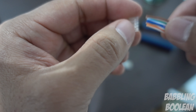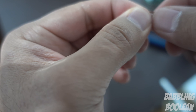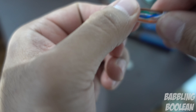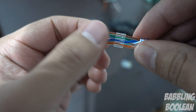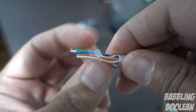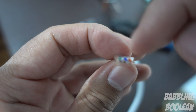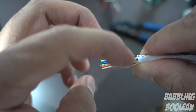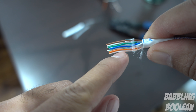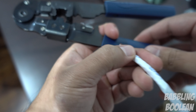We need to play around with this a little bit to get it to slide in. Once it's in, I double-check the order because sometimes in such a tight fit the wires can jump across each other. The bump is on top, the bottom is flat, and white-orange is on the correct side. I slide it up as close as possible and then cut any excess wire.